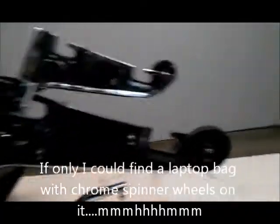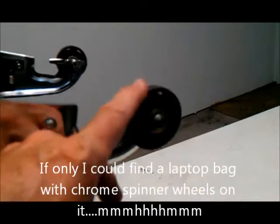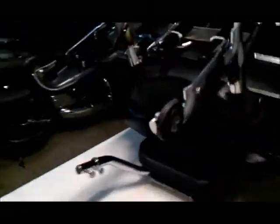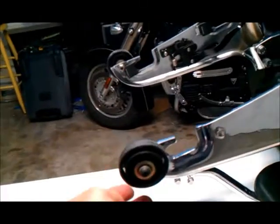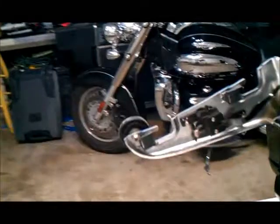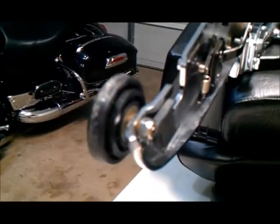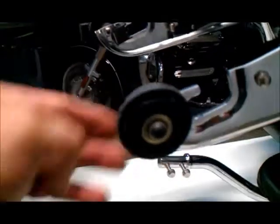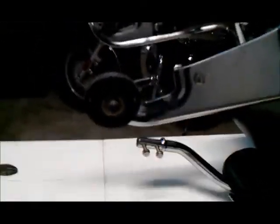I've got it upside down here. I want to show you guys where I added these wheels. These wheels came off of a laptop bag, but the rubber that coats them isn't very sturdy — it doesn't like the sun, so it kind of breaks up, so I just peeled it off. This is the frame up under there, and these work just fine. I drilled with a quarter-inch drill bit. These are quarter-twenty bolts, they're stainless so they won't rust, and these wheels already had bearings in them, so that worked out just right.